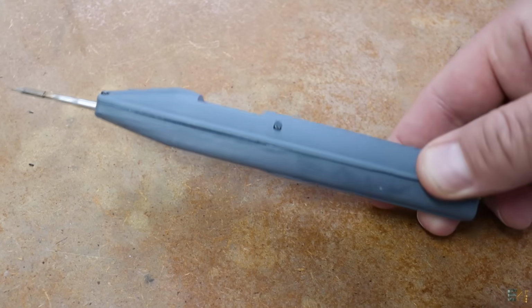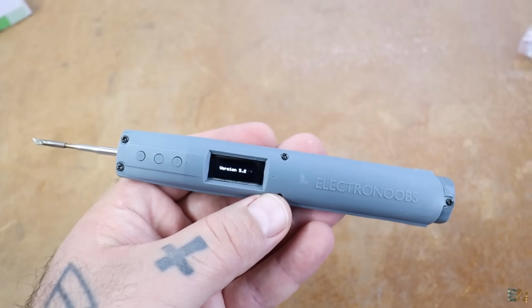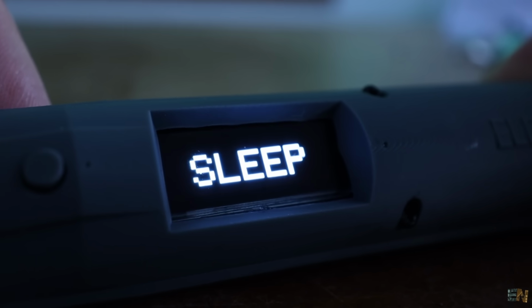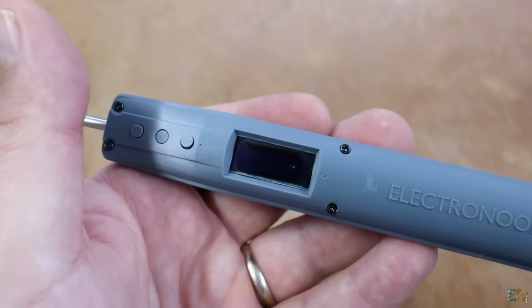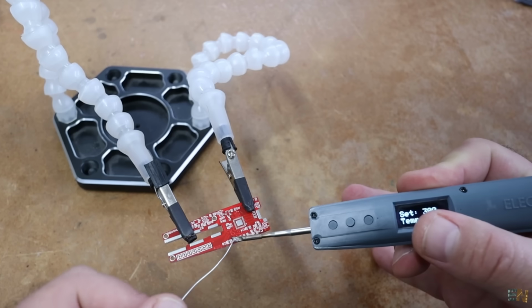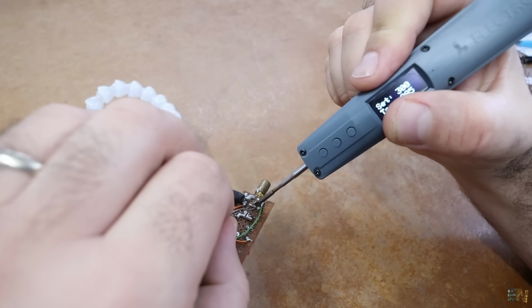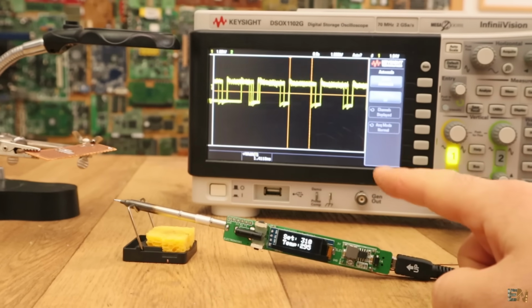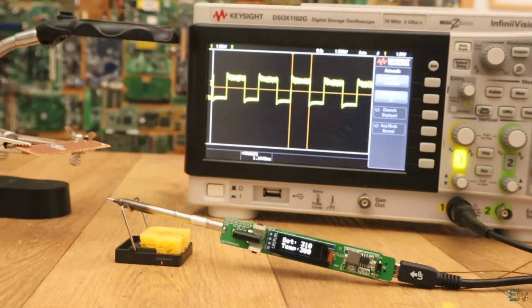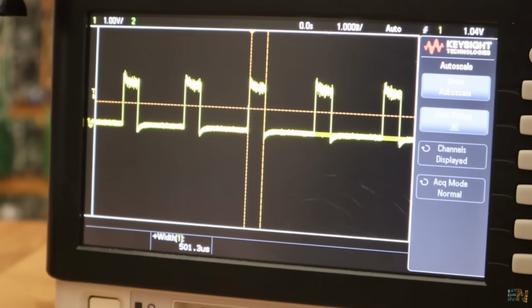And there you have it, a fully portable soldering iron. It has sleep mode, so it will turn off automatically when not used, minimizing the battery use, because we don't have much. Also, it only uses a lot of power when heating up or when in use. For keeping a steady temperature, the power usage is very low. As you remember from the previous version, we used the PWM signals to control the power, and just keeping up the temperature, the PID output is minimal.